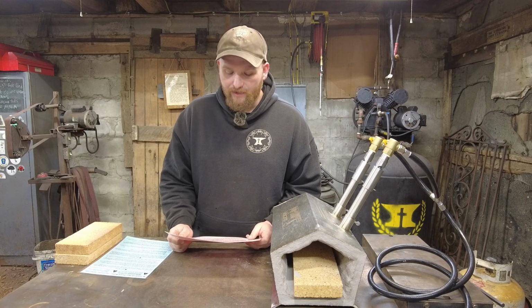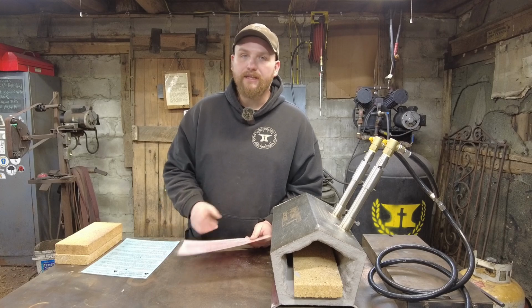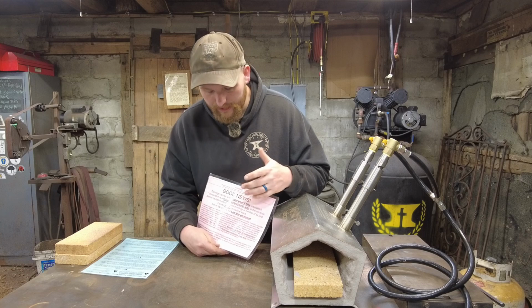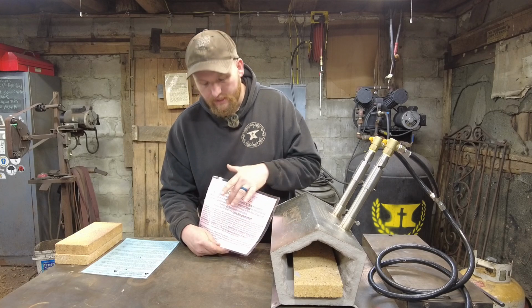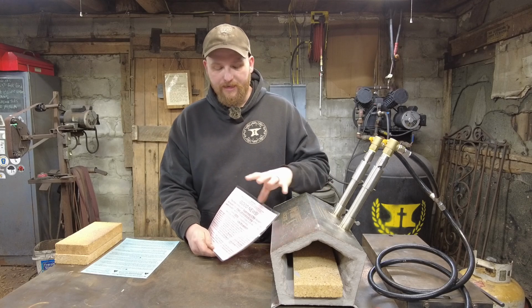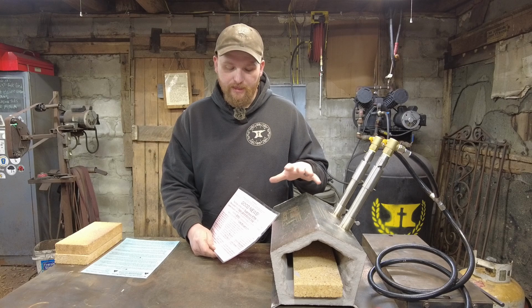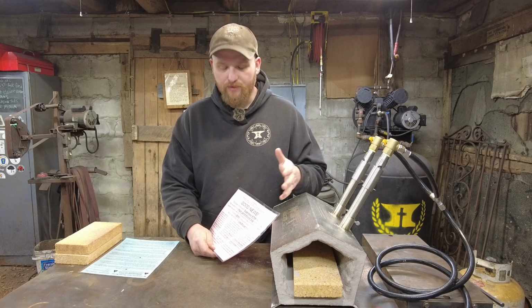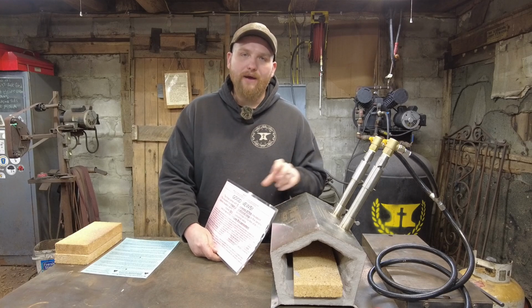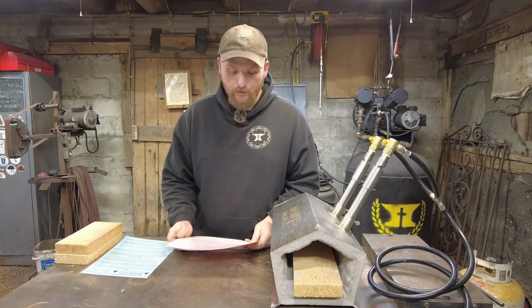And on top of that, it's low biopersistent. Again, this is all bolded on the actual sheet itself. They're trying to make emphasis that it emits no crystalline silica, so you're not getting those fibers off the fiber blanket, and it's supposed to be low biopersistent, so it stays in your lungs less time, so to speak.